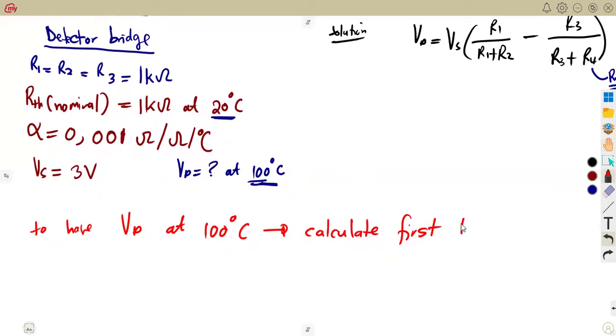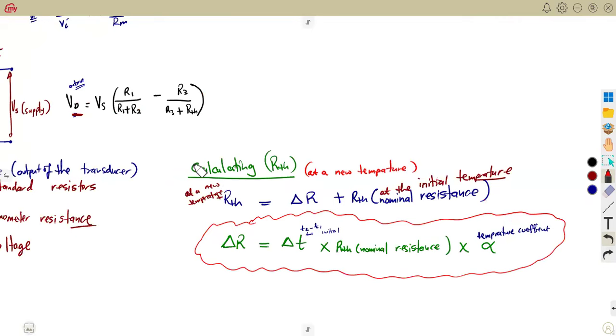RTH at that temperature, which is our R4 in that case. Okay, remember our RTH is our R4, which is our thermometer resistance. You have to calculate it at 100 degrees Celsius, at that temperature, whereas before it was at 20. So this is where I was talking about these formulas, to say sometimes they do it like that, calculating RTH at a new temperature. We need the change in resistance plus the nominal resistance. But we do not have the change in resistance. We are given the temperature coefficient